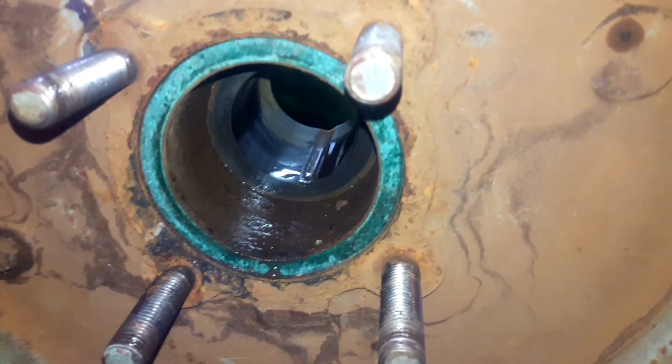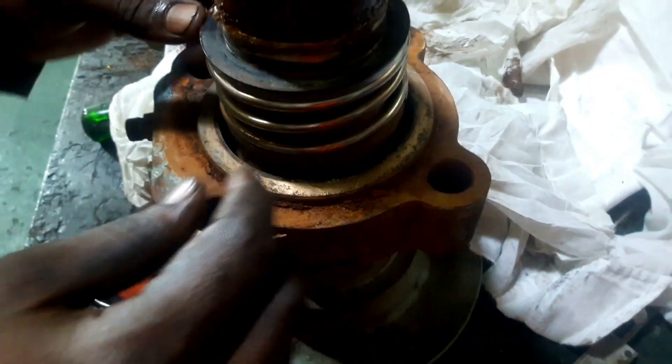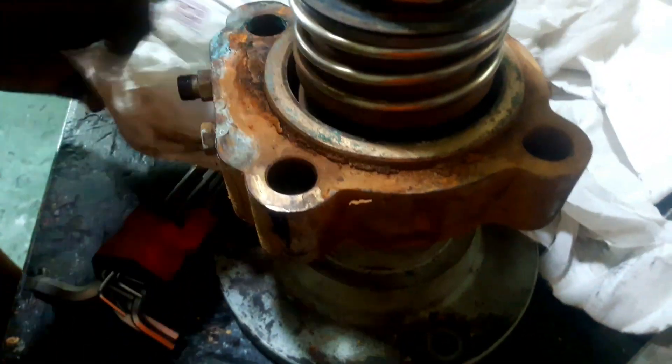Carry out the inspection of the bush. Loosen the socket set screw in the seal retaining ring and slide the seal off from the pump shaft. Remove the mechanical seal slowly.